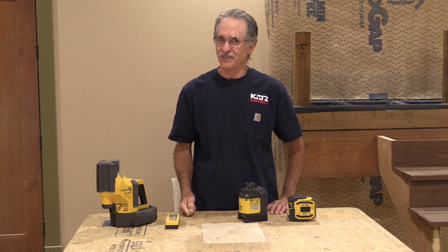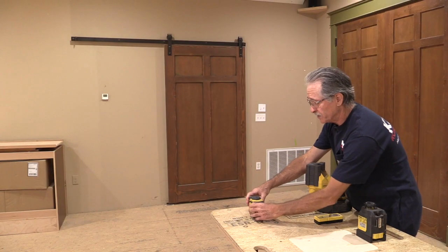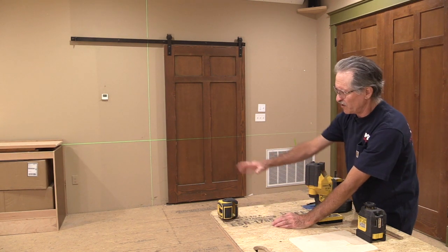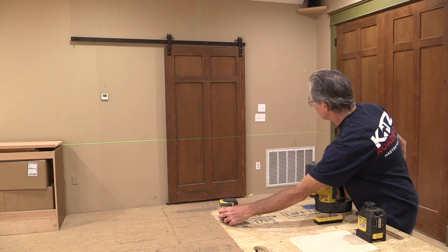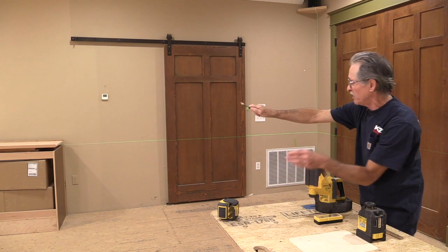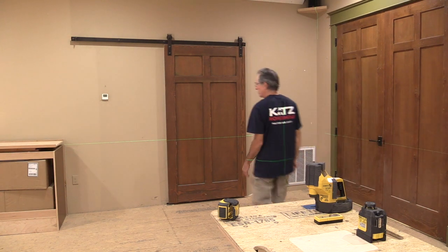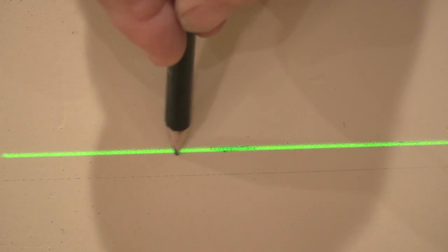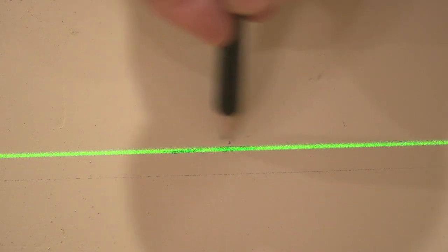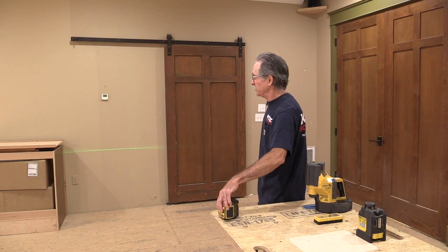Now that you've invested in a highly accurate instrument, how can you know for sure that your laser is calibrated accurately and will shoot a precisely level line? Let me show you how to test it. I'm going to take this laser, turn it on, and set it right out here on the edge of my workbench, close to the center of the room. Then I'm going to rotate it so that the plumb line is in the right corner, getting toward the max distance of the level line — maybe 100 or 120 degrees. Now I'll come to about the center of the room and put a sharp pencil line right on that green line.